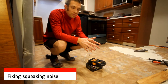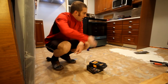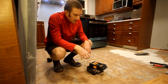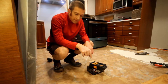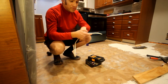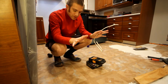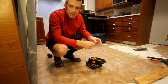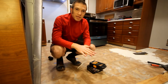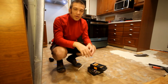If you notice a squeaking sound in your room, before you lay the flooring is the best time to deal with it, and it's surprisingly simple to fix. We know we have joists running this way, and we noticed a squeaking sound right around this area. We kept pressing a foot down until we found the center of the squeaky noise, then I drilled a pilot hole with my smallest bit to find the joist — I was only about an inch off on my first shot. I drilled the hole, stuck a piece of wire down to see if I hit the joist, went over about an inch, and then I hit it. I put a screw down there and the squeaking noise stopped. I added another screw about two or three inches apart. The squeak happens because your floorboard is just a little bit loose off the joist — it could be wood on wood, or old nails rubbing on the wood.